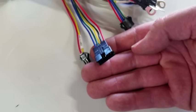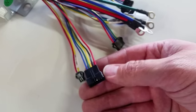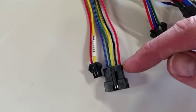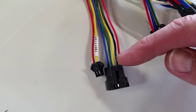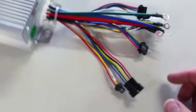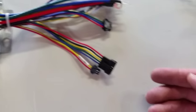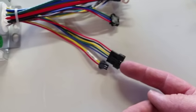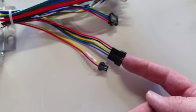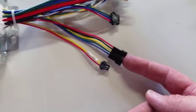The next connector is a female six-pin JST-SM connector. It looks very similar to the cycle analyst connector — in fact it's the same female side connector — except these are the halls. We have the plus 5V and ground, and then the yellow, green, and blue phases for the hall sensor. Some of the motors we sell have dual sets of hall sensors, meaning two outputs from the motor. You only need to connect one output to this connector; the second output is redundant — a spare in case your hall sensors go bad on one side.